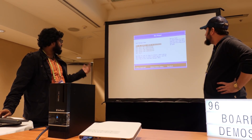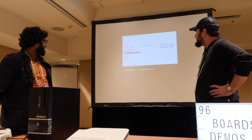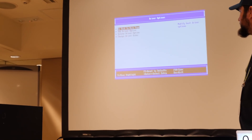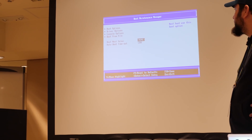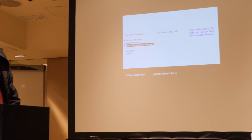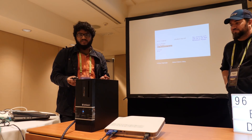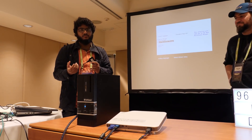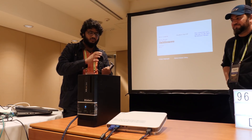You can go into the boot manager — what we'll do in a second is boot something from USB. There's also a boot maintenance manager with board options, driver options, and you can add other items. We've gone ahead to Fedora's ARM64 download page and downloaded a generic ARM64 build ISO. This is not like other boards where we have a specific build for Debian or Linaro builds — this is a generic build and it works out of the box.